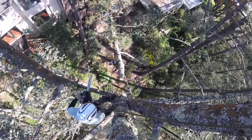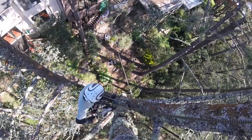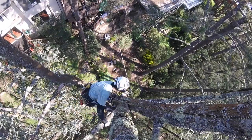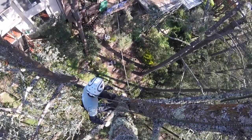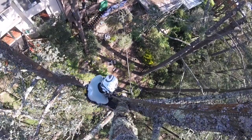This next clip shows where we're rigging to overcome terrain, drifting things to the roof using that spar pole to make it easier. We could have rigged it straight down but it would have been terrible climbing stuff up that steep hill and then up those stairs. So we're using rigging to make life easier.